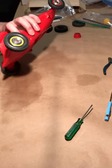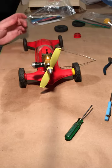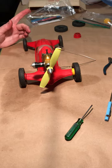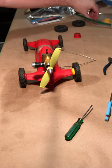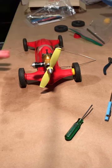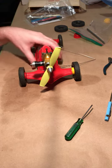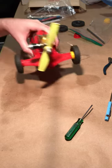The car wound up with one Shrike wheel and one prop rod wheel. Some observations: the prop rod wheels are not the same diameter through the shaft. The shaft for the Shrike is smaller in diameter and shorter in length. So I had to pry that wheel off, clean up the axle, reuse it, and hand-machine the Shrike wheel to fit the prop rod axle.